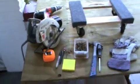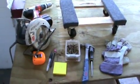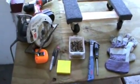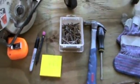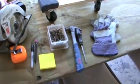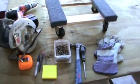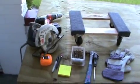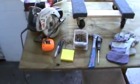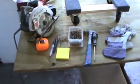Today I'm going to be discussing my solar panel kit and how I'm actually building a base to sit the solar panels on top of. These are the tools I will be using. I'm building a 24 by 21 by 16 inch base with a cover to sit the deep cycle marine batteries in. I'll start making my measurements, get the 3/4 inch plywood cleared off, and then we'll go from there.